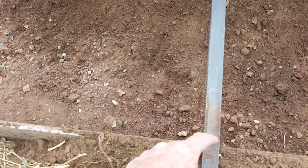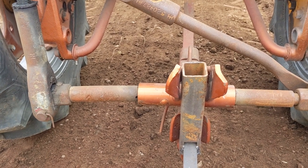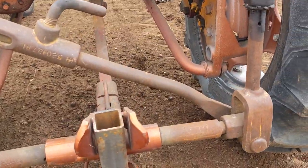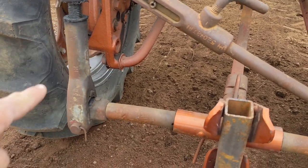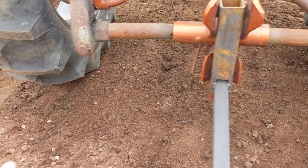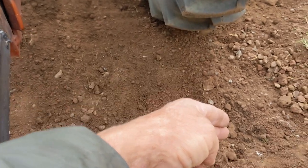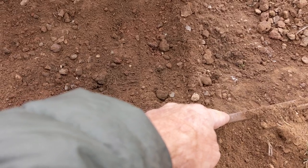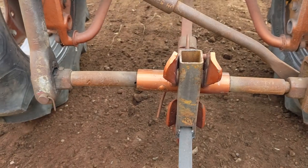At some point, I will cut this off and turn my quick and dirty fast hitch insert into a lift. And then I will come off there on the final drives with a trailing link back, and then use this with an adjustable top link. And that way it'll come from there back to the grader blade, which is under the dirt here. And then I'll weld a tab on so it can articulate up and down. And then the top link will just do the movement.